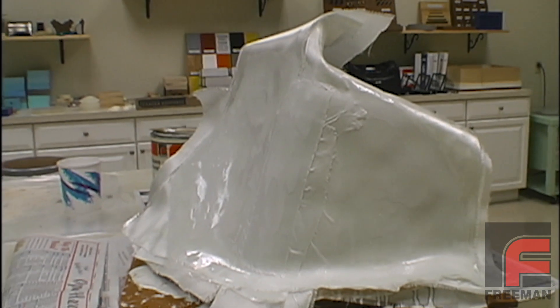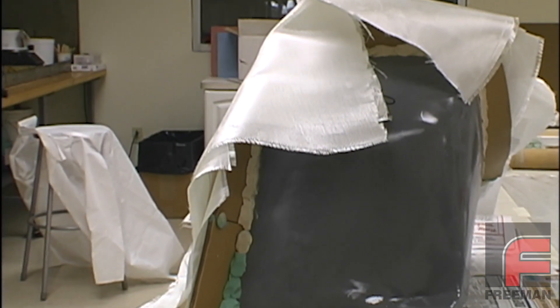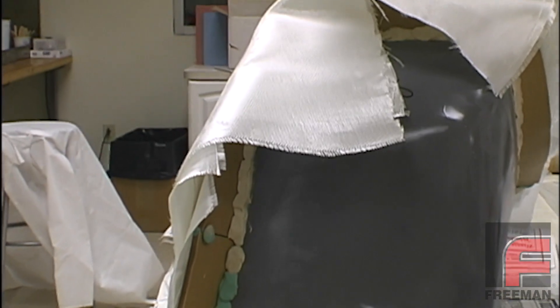If we had been following the epoxy laminating system, we would still be laying up our maximum of 12 layers of fiberglass cloth per day and then have to finish up the part tomorrow to add the additional layers required to build a strong tool.